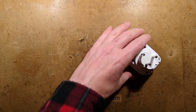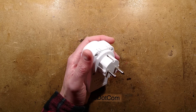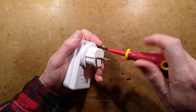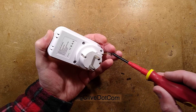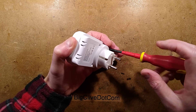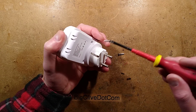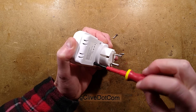It is reassuring that some power is being drawn. I don't know if it's going to be a capacitive dropper or a switch mode power supply. It does say 110 to 240 volts, but that doesn't always mean anything because you also get capacitive droppers that do that — they just pass a ton of current at 240 volts versus 110, with much more heat dissipation at the higher voltage. Or if it is a switch mode, will there be a bulging capacitor inside? We'll find out once I've opened it.